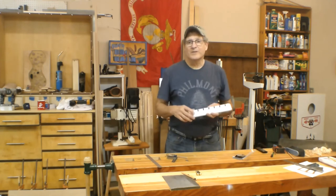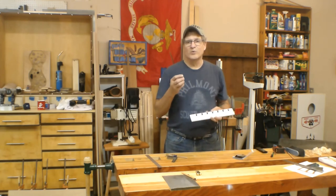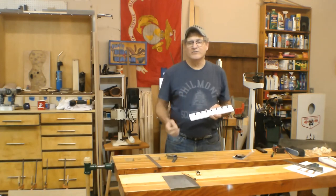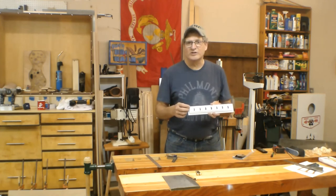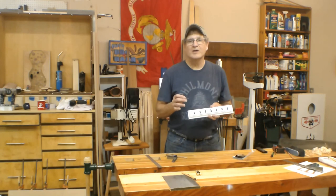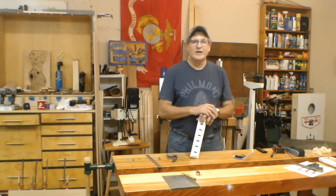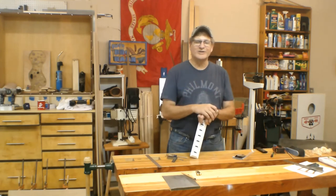Now, the other thing is, when working with kids on this, make sure you drill a 1/16-inch pilot hole for the screws. They're small screws — they take a number one Phillips — but they need that pilot hole or the kids will get really frustrated. These are only single-screw hooks, so they're very fast and easy to install. Keeps the kid's frustration level down, and keeps your frustration level down too. I'll put links in the bottom for some of the tools I used, including that 1/16-inch drill, and there's also a link for my blog. I hope you had fun watching this — if you did, please hit like and subscribe. Until next time, good making.